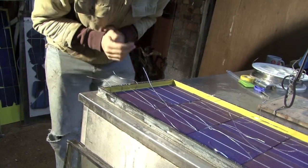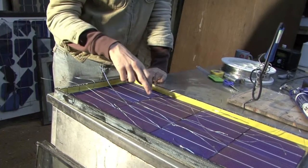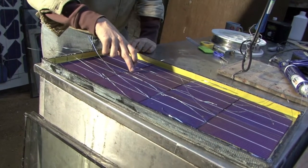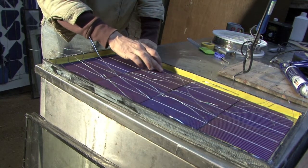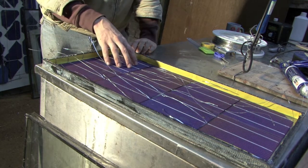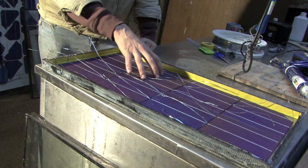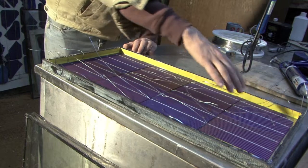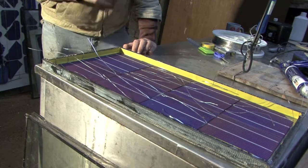What we're going to do now is simply go up and down these columns and solder, just like we did on the back, but this time we're going to be soldering the wires coming off the bottom of any given cell onto the top of the cell coming after it — going from the positive underside of each cell onto the negative top of the next cell. So positive, negative, positive, negative all the way around, giving us a series circuit of eight cells.